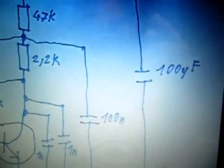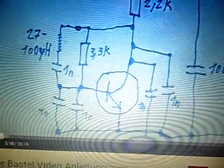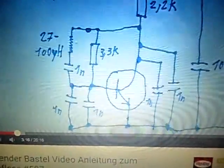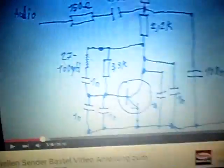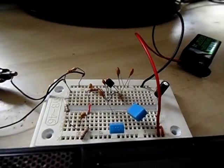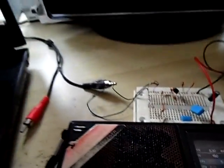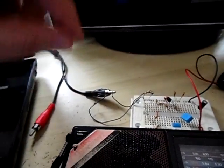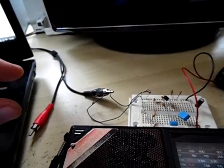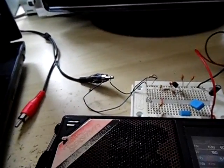It's really power-saving. It uses a standard NPN transistor like 2N3904 or BC547. For the coil, you can either use pre-made coils in series as I am doing, or you can wrap some wire around a double-A battery with some paper between it, then pull the coil off the battery and then you have a transmitting coil.